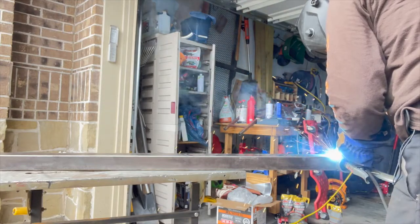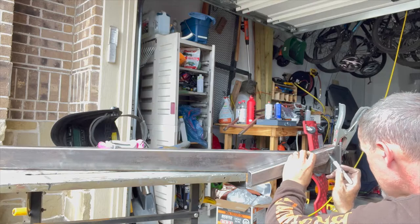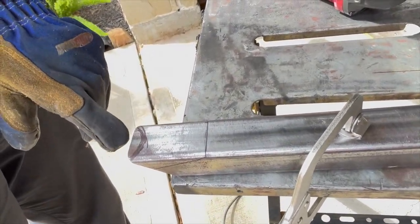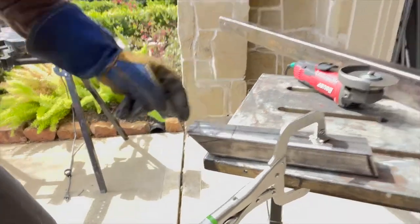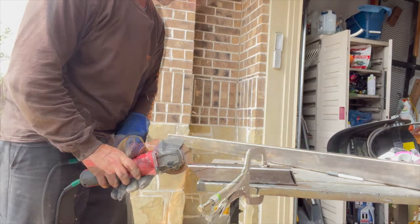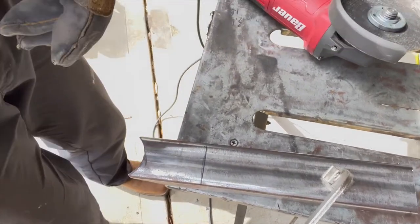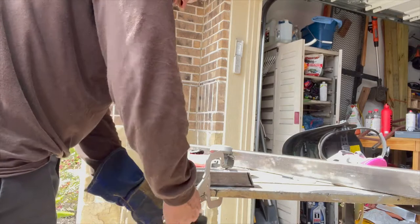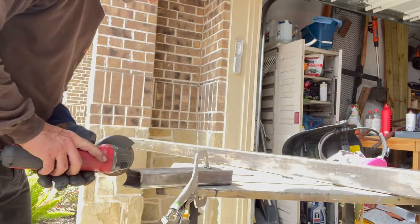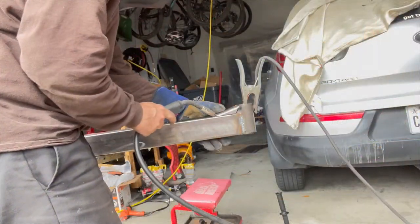Now I've finished welding the collar to the swing arm. I make sure to take all the bearings out — I don't want to heat those up. I want to put a little support bracket across the top of the tubing. It's a four-inch collar but I used two-by-three tubing, so I get another inch of support on there. I'm coping out a circle to fit up against the collar, do a couple of relief cuts, cut those out, and sand it down. It doesn't have to be super exact since you're putting weld in there, but the tighter the better. I cut the triangle off, pop it into place, tack weld it, and burn it in.